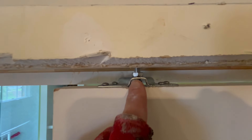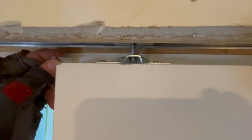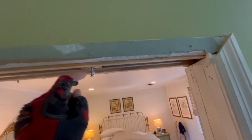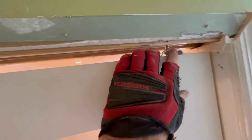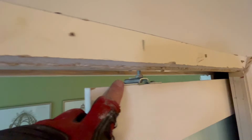You see a little space between the bracket and that nub, and the lock should go on that side. But we can't do that because this is in the way. Now we're taking off that piece of casing and that piece of frame so I can get the wheel on and put the locks on properly. One part slides under the bracket, one part slides over the bracket — now that thing can't move. Don't skip that part. I've come to repair pocket doors that got stuck inside the pocket because someone didn't put on that lock. Make sure they're pushed all the way on in the center and nothing's binding.